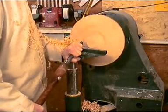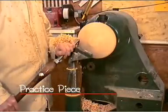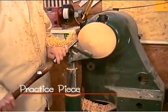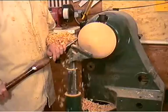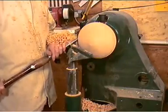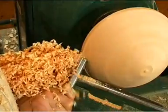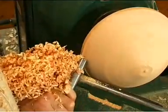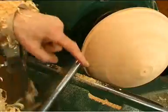Remember this wall in front of the cut — I will mention it again. Watch now again how the tool is held in tension between the two hands. The rest position is also important. The cut that moves along parallel to the rest is easy to control. Cutting away from the rest like this is also easy. Cutting at such an angle that the tool comes round at right angles to the rest or greater is less easy.